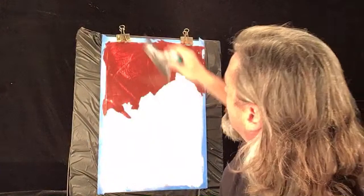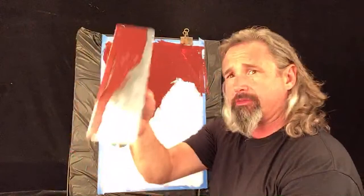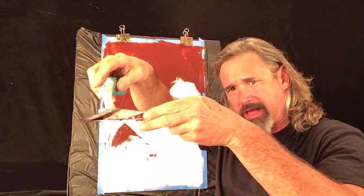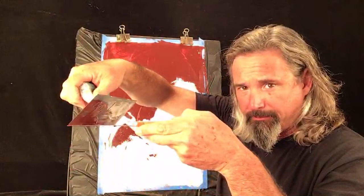This is typically done in three applications. You'll see I'm starting from the wet and pulling to the dry. When I put it up you'll see how it spreads. When I'm working, the trowel is almost flat so it slides across the surface. Then when I come back — what I call the gather up — I pull the other part, which is pretty high up on the blade.